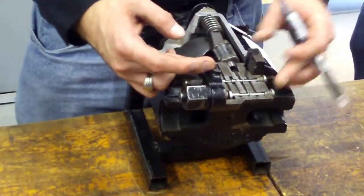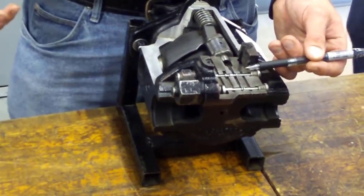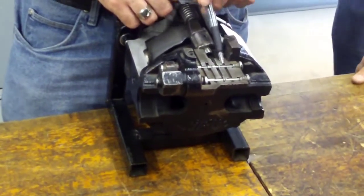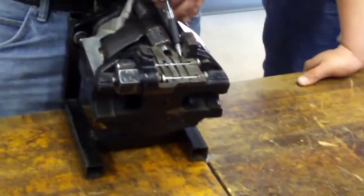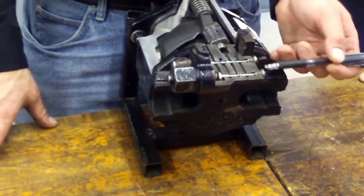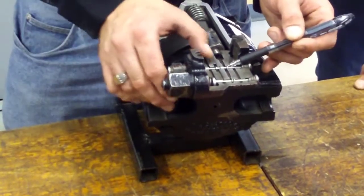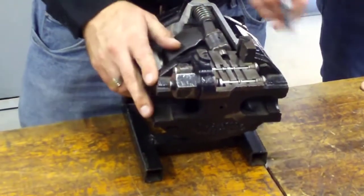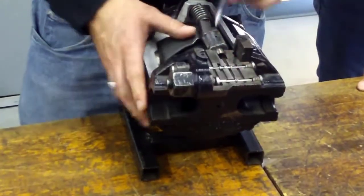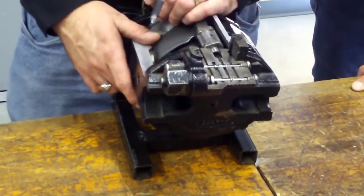Your load sense spool is the one that will shut the pump off when we've satisfied the demands of the system. There's a port that comes up here from your pump output pressure. Whatever your pump output pressure is, it comes up here and pushes on the ends of both spools. When it pushes on the end of the small spool, it only has to overcome typically a couple hundred pounds of force. When it pushes on this one, it's going to have to overcome several thousand pounds of force — that's representative of the surface area on the end of the spool versus the spring tension.